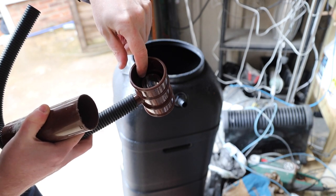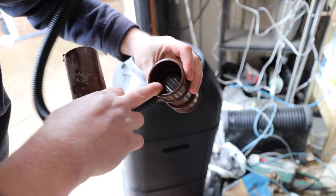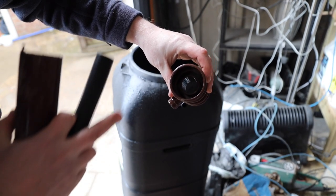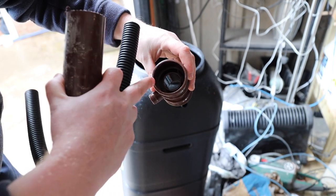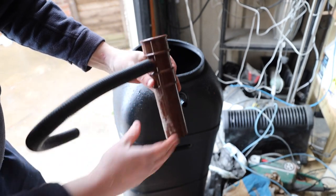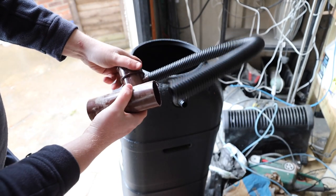So what happens is, you have your pipe like so, but here's a piece of pipe, and it goes down the spout, enters, there's a little hole, you probably won't be able to see that, where the pipe is. Hopefully you can see that, the little hole. Can you see that, guys? Anyway, water fills that void up, and once it gets full, because the water spout is full, the water will overflow and then go down. So you'll have another piece of pipe and it'll literally flow down the rest. So essentially, that's how it works. And it looks quite nice put on there. So all I need to do is get my piece of pipe, cut it to the right size this time, and then it'll be ready to put on, okay?